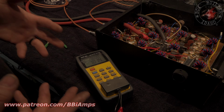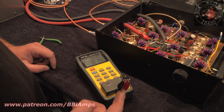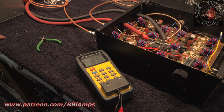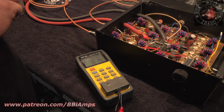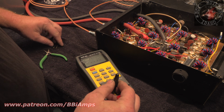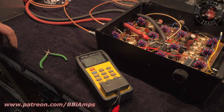So even the builders knew back in the day that this wasn't a high enough kV capacitor, this little guy. These caps take a bucket of pressure, like a bucket of pressure, electrical pressure, that is. So this is supposed to be a 680. Of course, this is plus or minus supposedly 5%. Well, it's actually technically out of tolerance at 700, but here's our problem.